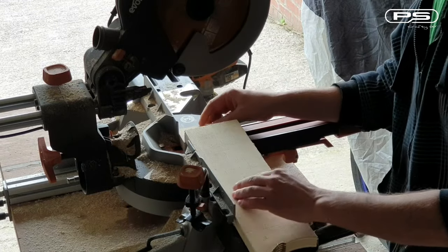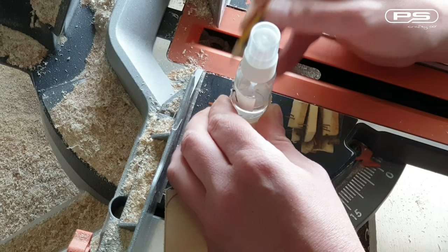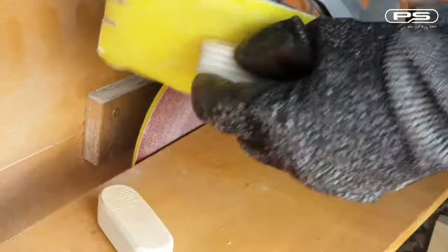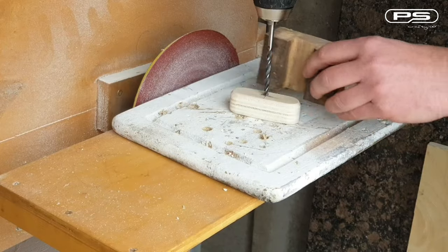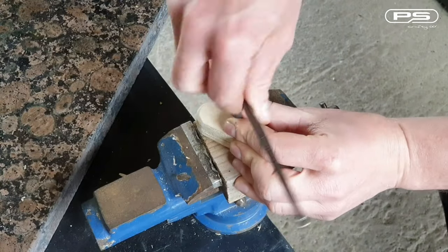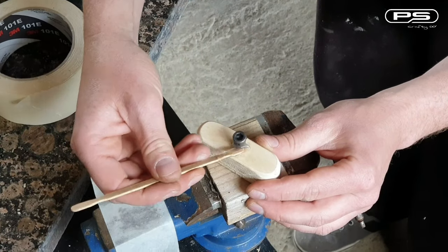The table is going to be mounted on using two knobs, which is what I am making next. I am using a scrap piece of plywood and a very sophisticated compass to achieve a perfect round shape, then shape the pieces on my disc sander, smooth them out with a sheet sander, mark the centers, and drill them out. I then partly drive in the screw, apply two-part epoxy adhesive around the screw head, and drive it in flush.